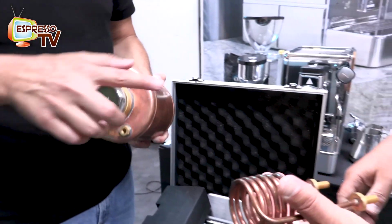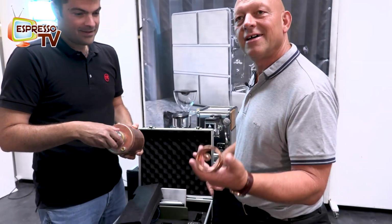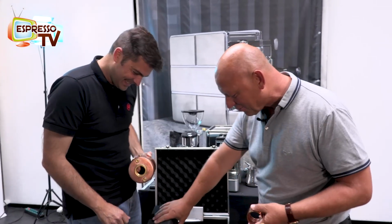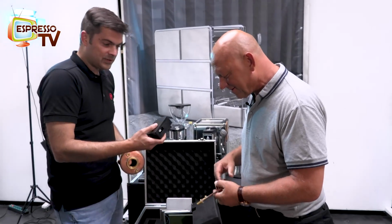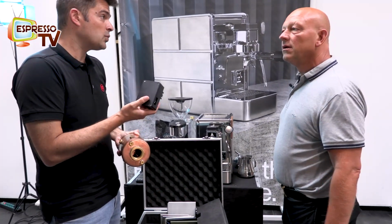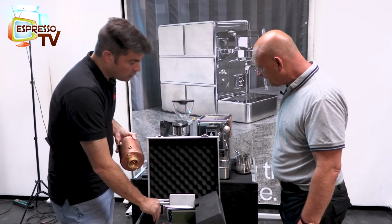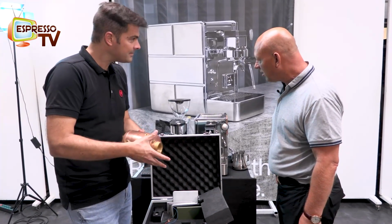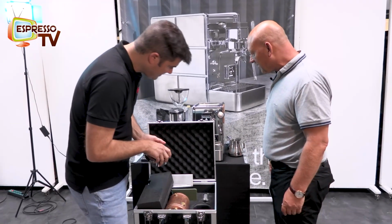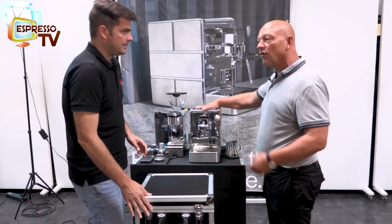And this is the siphon system. Exactly. Many heating elements look like this, so at first you think, that's a heating element? No. Yeah, that's really cool. Of course, last but not least, a very simple electronic. We decided on that machine to be, let's say, 90% mechanical, but of course we need the level control and the tank control. So that's why we decided to have a very simple control box in the machine. And of course, the machine is always a piece of design, and it's responsible for the extraction of the essential oils out of the coffee bean.